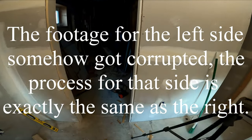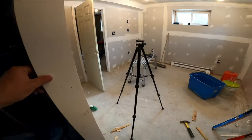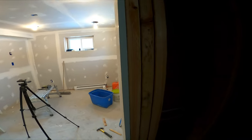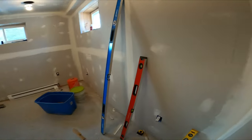All right, so when your door jamb is done, it should look something like that. Nice tight seams. All right, everything's nice and secure. I went ahead and put the other side on here. It really only required minimal shimming because we took our time and made sure the rough-in opening was done correctly and was plumb. So just a few little shims here and there, but for the most part it's attached almost directly to the framing.